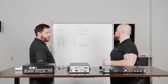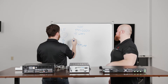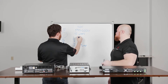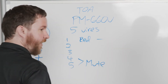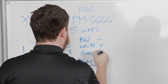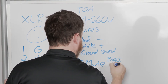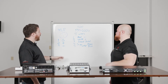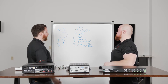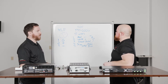In the case of the TOA PM660U, here are the magic answers for wire colors: your red is your negative, your white is your positive, your ground is just your shield, and then you've got black and blue, which are your mutes. If you're going from the PM660U right into a 70-volt mixer amp and you don't have room for a mute, you can just use the audio wires. No need to use your mute if you don't actually need the muting function that's built into the mixer amplifier.